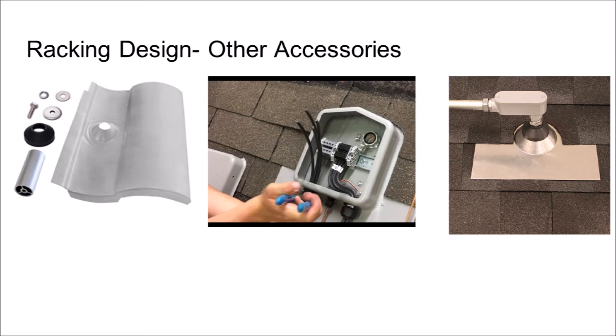One caveat on trying to make the rooftop transition work elegantly with generic off-the-shelf components is that there is only about four inches of clearance between the roof deck and the very top of the solar panels themselves. Often, junction boxes found locally are six inches deep, so if the goal is to hide the transition box underneath the array, by the time one considers the height of the pipe boot and the height of the box, it is easy to be in conflict with the array itself. When using generic off-the-shelf components, I will commonly skip the box on the roof simply by transitioning the cables through the conduit via a cable gland and then landing in a box in the attic, accessible just underneath the solar array.